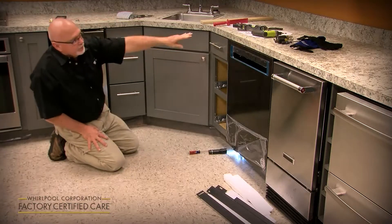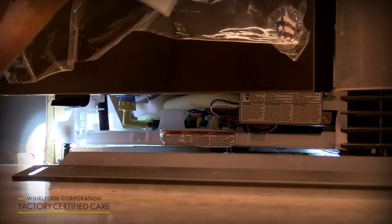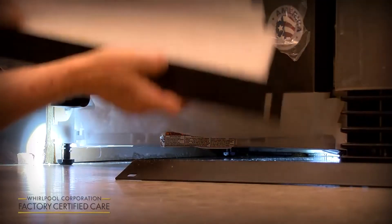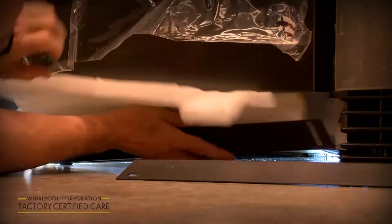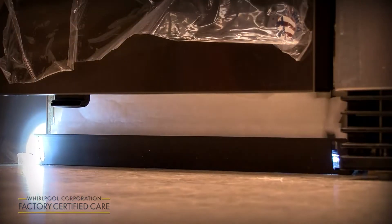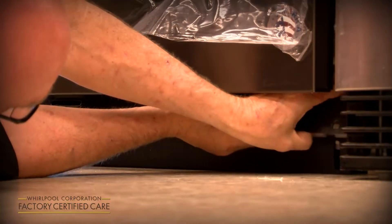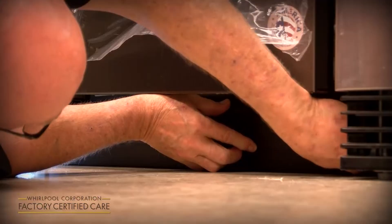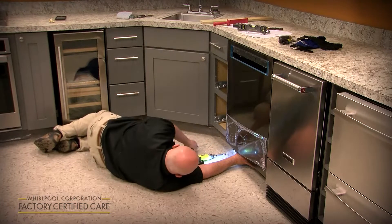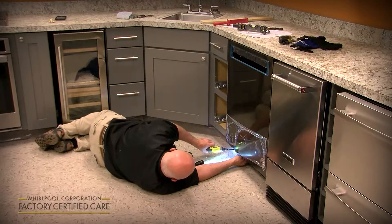Once you've confirmed there are no leaks and the customer approves aesthetically, put the insulation pack back in — this one tucks up in there, and then the adjustable one goes up and down to cover the gap in the floor. The insulation tucks up underneath the door. A nice new feature on this model: two cutouts and clips on the toe panel — just clip it on both sides so it stays in place while you find the screws. Start the screws first, push it down to the floor to cover the gap, then finish tightening.